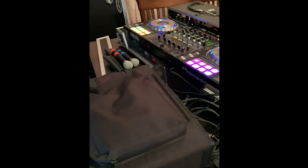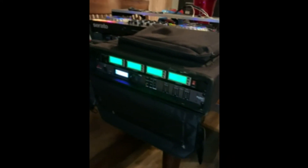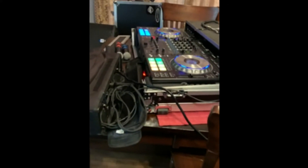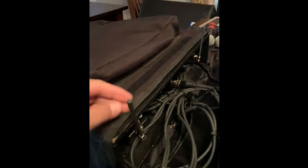The other modification that I did is I replaced those big antennas, because this one comes with four antennas. I cannot mount four antennas on this thing because I have it in this rack case. So what I did is I replaced those big antennas with these two antennas, which are the Shure antennas. I believe these are the halfwave antennas.